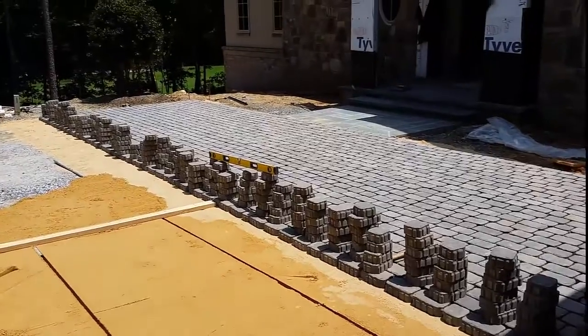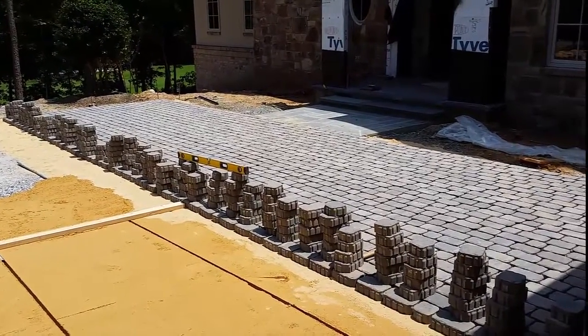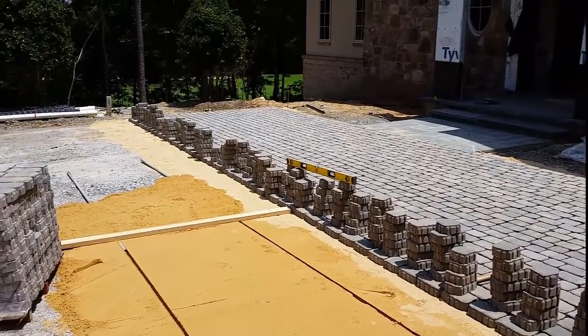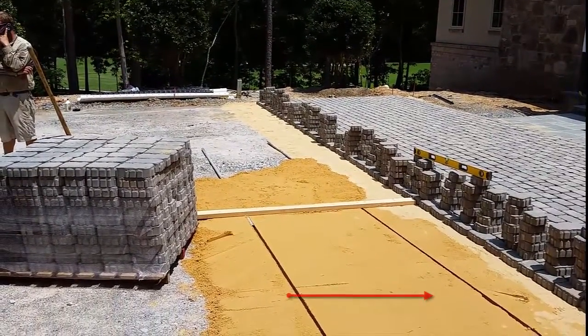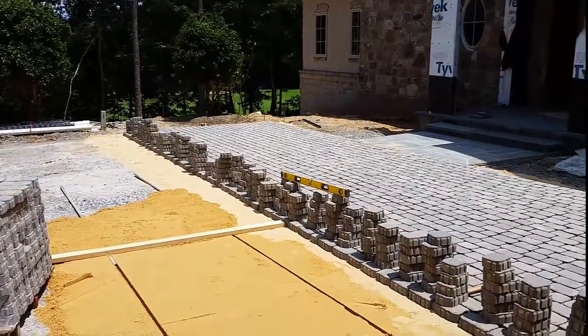Working on top of a properly compacted and leveled soil base with a small slope for drainage, sand or stone grit is placed as an underlying bed that the pavers will be set upon. Here the installer is using two steel pipes to regulate the thickness of the base. He moves the pipe as he goes.